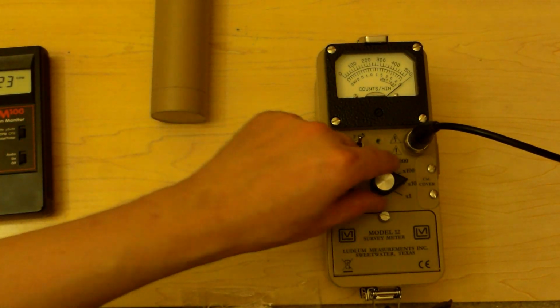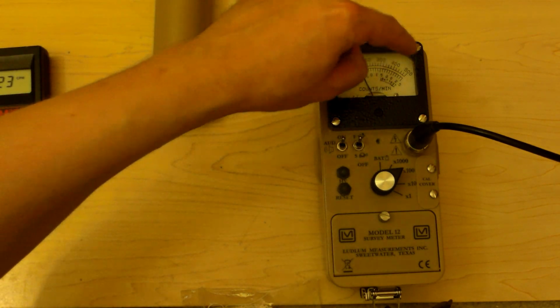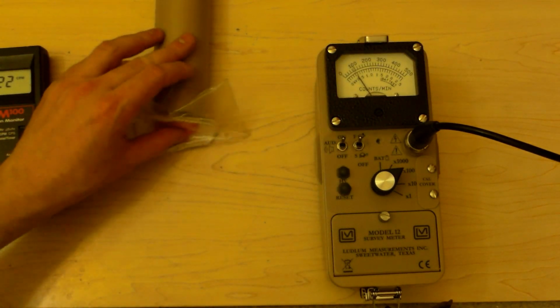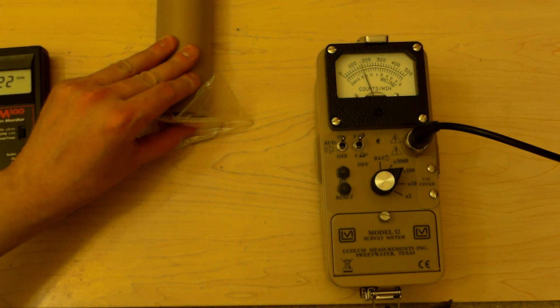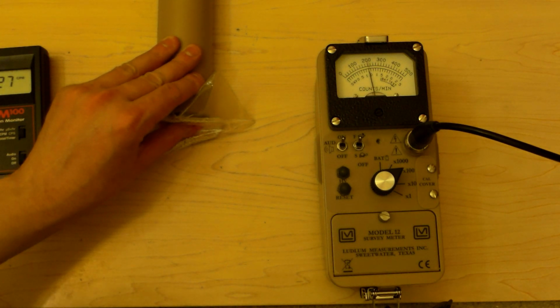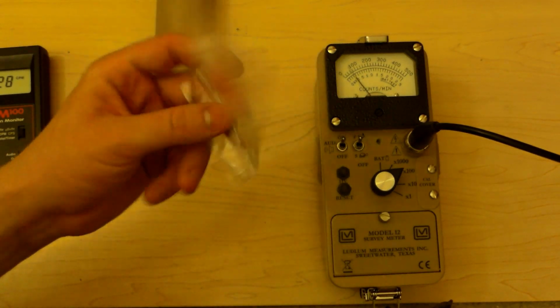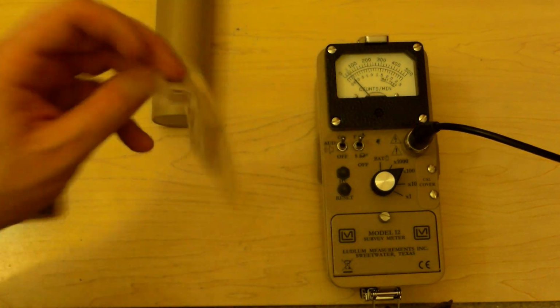People used to go camping with this stuff. And it's off the chart. Times 100. 0, 10,000, 20,000, 30,000, 40,000, 50,000. About 20,000, so about 18,000. We had 2,000 counts per minute as our background. So about 18,000 counts per minute. Not bad, thorium. That's the thoriated lantern mantle.